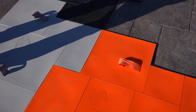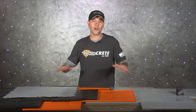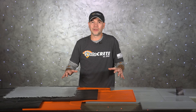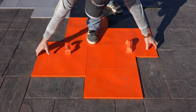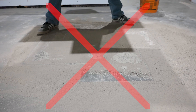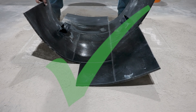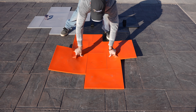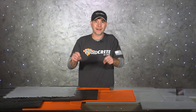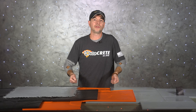One little bonus tip before we move on — and this goes for pretty much any grout line stamp — is don't use the handles. Now if you're not supposed to use the handles, why put them on there? Let me rephrase: use the handles to break the suction, but not to pick them up. The problem is when you use the handles to pick the stamps up, it's just really hard to not end up having a few spots dragging across the concrete. Once the stamp is freed from suction, I prefer to pick the stamps up all the way out on the edges. If you do have to use the handles, hold them so the pressure is all towards the middle, make a big taco out of the stamp with as few spots touching as possible, then pick it straight up.